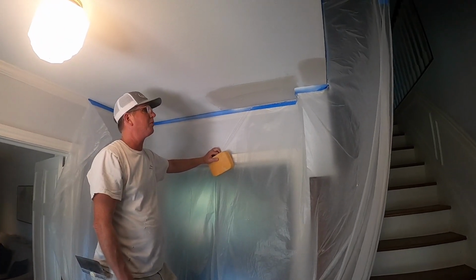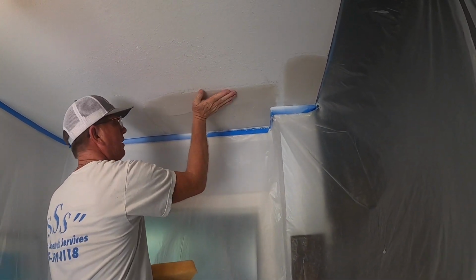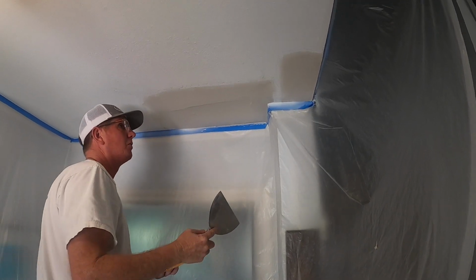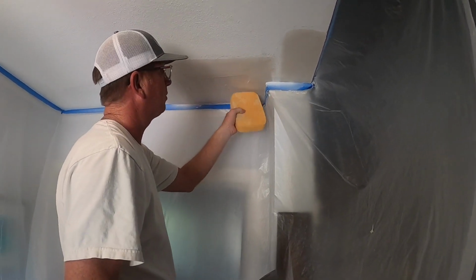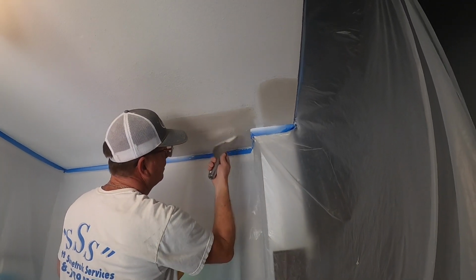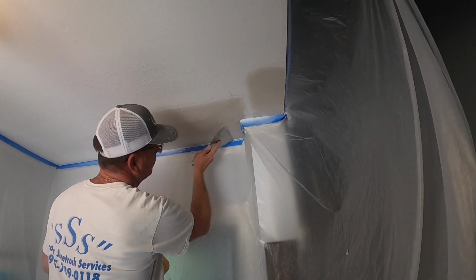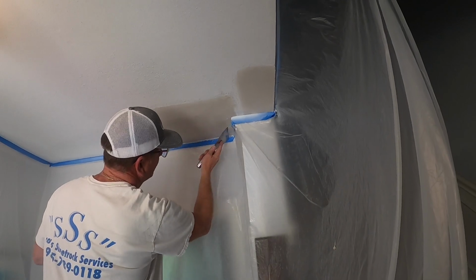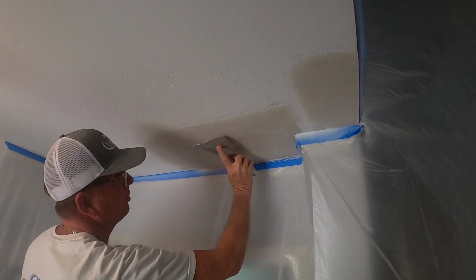Alright, so we're back. We got everything plastered as you guys saw right now. This is about 7 minutes later and it's rock hard. So when it gets too hard, I'll try to damp it a little bit with a sponge to help me rake. So that's what I'm gonna do. Just high side of the knife and just keep moving it. And then everything you take off your knife, you're gonna fill in pit holes or anything like that. It's a molding agent. That's why I like plaster.